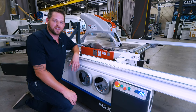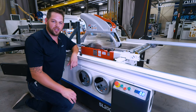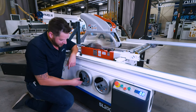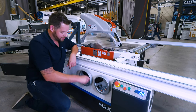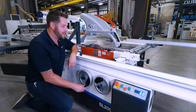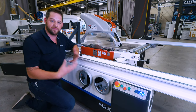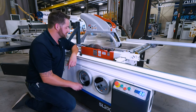Taking a closer look at the SL200's controls, we've got a very operator-friendly, manually adjustable setup right here in the base of the saw, easily accessed by any operator. Our main blade height is adjustable by hand wheel right here at the bottom — simply release this locking lever and I can adjust my main blade height up and down manually, whether to raise the blade up to cut through thicker work pieces and achieve my full projection, or to pull it down into the base of the saw at the end of a shift for safety reasons.